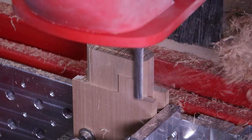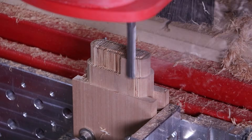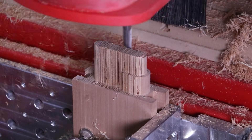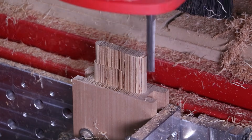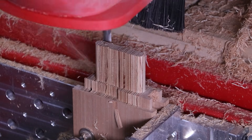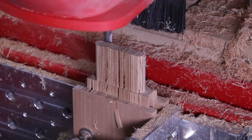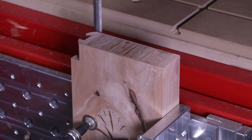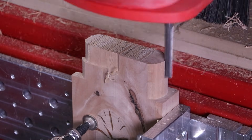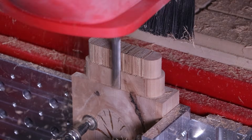One thing I've learned from personal experience is to do a test cut with your joints before you actually apply this to all of your parts. Here I was able to perform a test cut just on the very top surface so I can measure that with calipers to ensure that everything is dead center before I apply this to the rest of the tenons. Each rail — the top, the middle, and the bottom — all needed to receive separate tenon programs that were unique to those components.